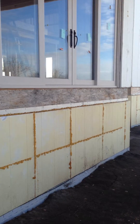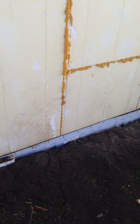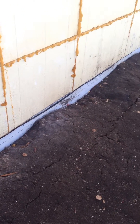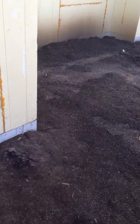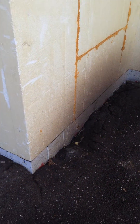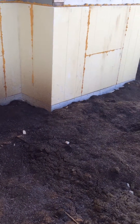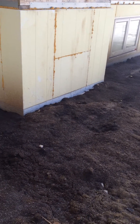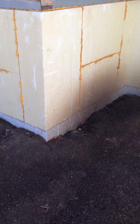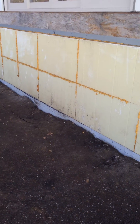Something I wanted to show you guys here on this polycore house — you can see the membrane here. One thing they may want to come back and do is just put a little wear strip at the top of this lip to protect it, because otherwise they may have some problems with the membrane peeling back or getting damaged. So we'll talk to them about that.